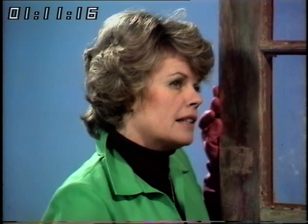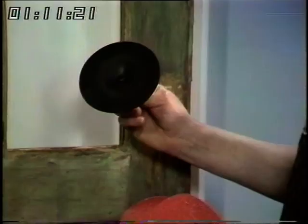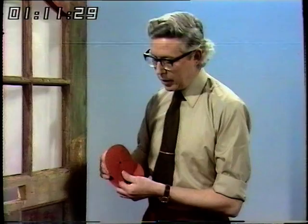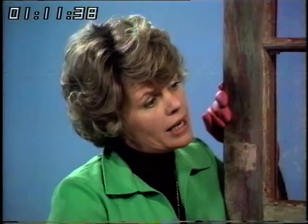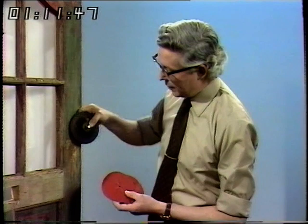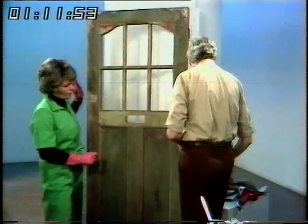If you don't want so much elbow grease you could use a power tool. Most people are familiar with the disc sander — these are discs which clip in and revolve in a power tool. I did want to warn people about this because it's revolving and at some stage it will cut across the grain of the wood. Some people say hold it at an angle so it only touches on one side, but even there you're getting a cut across the grain and it will scratch the wood quite a bit.